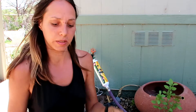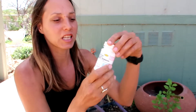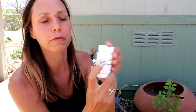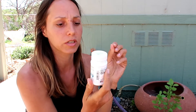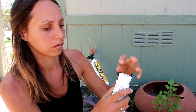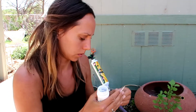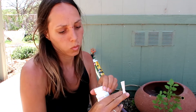These test strips are EPA-approved, so you can actually use them like a utility worker to test drinking water. They are legit — Sensafe Free Chlorine Water Check. If you have chloramines, the free chlorine test may not detect them, but if you have straight chlorine it should. These supposedly expire in 2020, so I've got a lot to use in a couple of years.